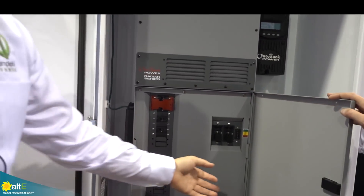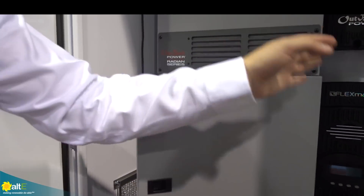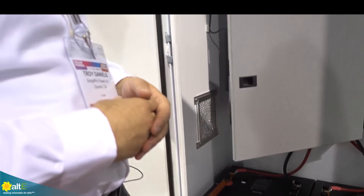So can you show me the basics of how you'd wire it up on site? So you've got it on site — we're already outside, we have our PV running down from the roof. Within the unit we have knockout holes to run your wires in. Here we can see this is the Outback GS load center, which comes already wired up, and there is a DC bus in here that we can land the PV on. We would land our PV in here and have the PV charge the battery from there. The batteries do not come wired — the cables are hanging down and we connect to each terminal to wire the battery. Then out of the GS load center, we would run our AC output to either a critical loads panel or a main loads panel, whatever we're looking to power.